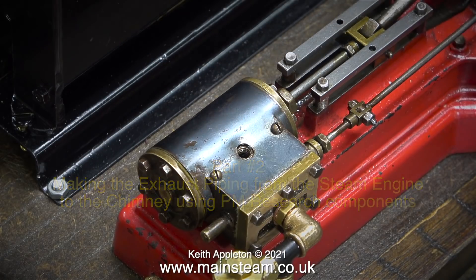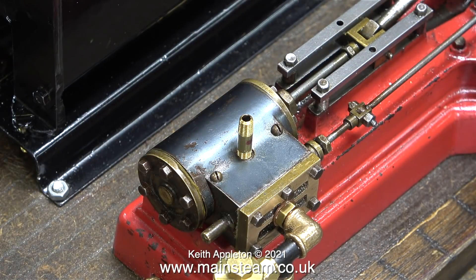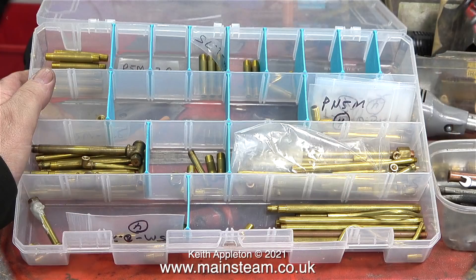I'm starting the job at the cylinder end by fitting a small PM research threaded pipe. These parts are very useful things to have in the workshop. This particular pipe is threaded 3/16 by 40 threads per inch, and luckily I have quite a few different sized PM research pipes. Selecting the correct piece of pipe for a specific job is important. A Stuart S50 steam engine is quite a small engine with only a 5/8 inch bore, and the PM research piping threaded 3/16 by 40 is going to be okay for this job.